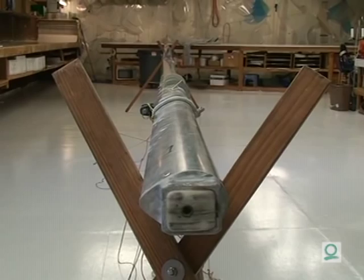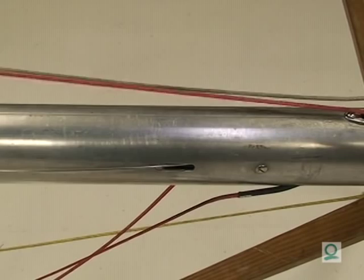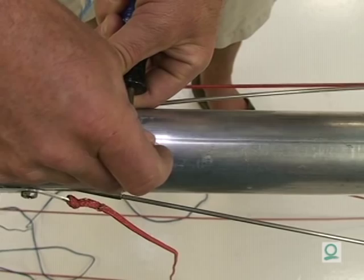When you're measuring your intermediates, you want to make sure that your forestay and jib halyard are not caught inside the intermediates to get an accurate measurement. Measure an intermediate by pulling the intermediate down the front of the mast with an edge, careful not to push on the mast very hard, and mark with a needle into the mast or a magic marker to make a small mark.